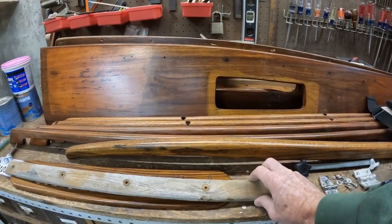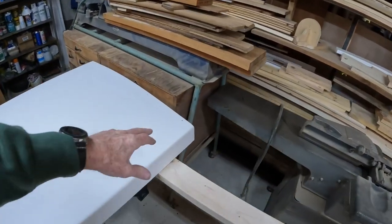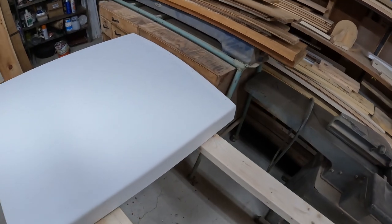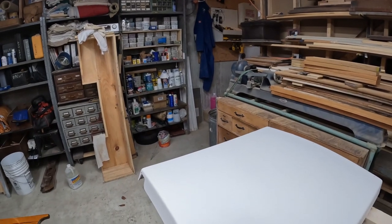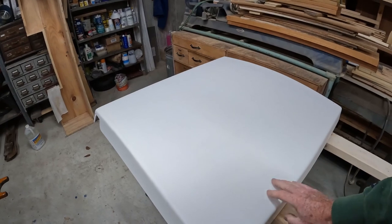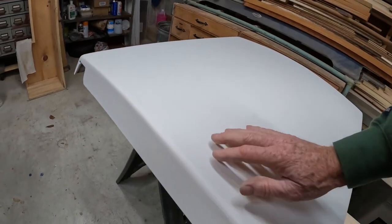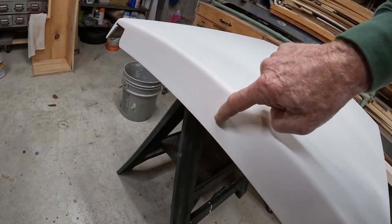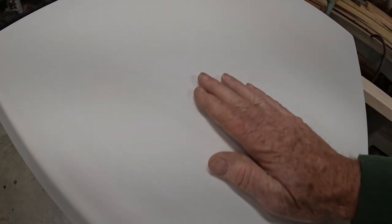And then this little piece of teak that I'd forgotten about was on the leading edge of this. I didn't film this, but I lightly cleaned it all up, lightly sanded it, and put one coat of primer on just to see how the primer worked. I rolled it, and I rolled and tipped this one. I did not tip this one. You can see a little bit of roller texture — not orange peel, but still just a little bit. This one doesn't have any roller texture and it looks much better. So I think I will be rolling and tipping everything.